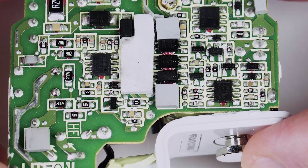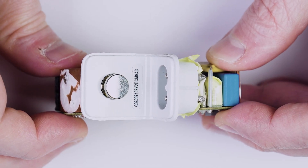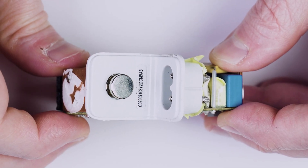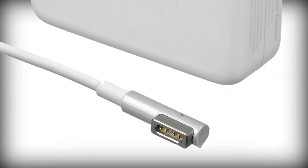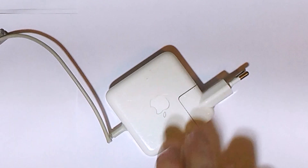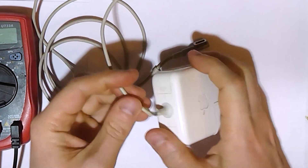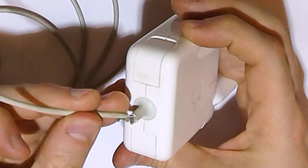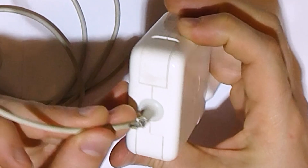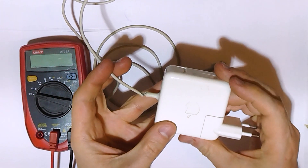In this case, while the converter inside the charger is running, the MOSFETs responsible for switching the output are off, so there is no voltage at the output terminals. I have not tested this particular charger yet, but before we proceed to opening it, to save time, we have to make sure it's actually working. What I'm going to do now is first make sure the output is not shorted, second solder a couple of wires toward the left of the cable, and measure output voltage with the help of a multimeter.